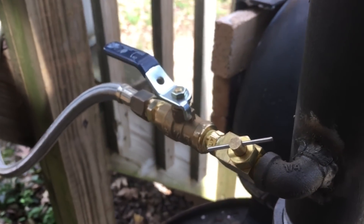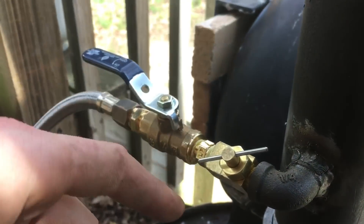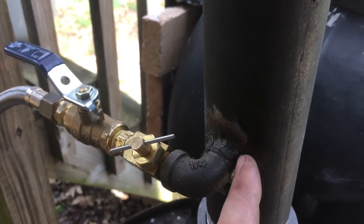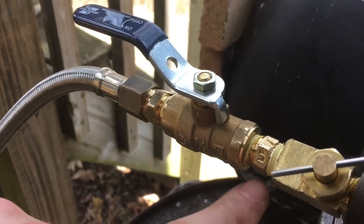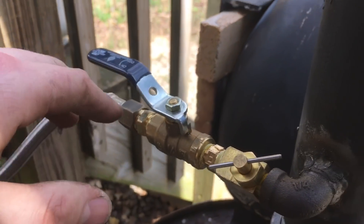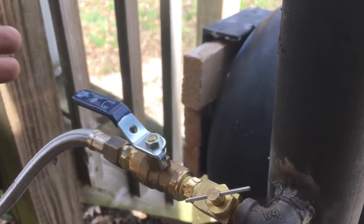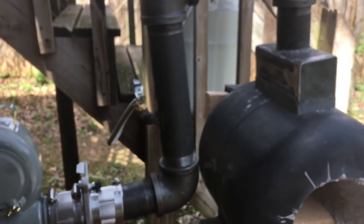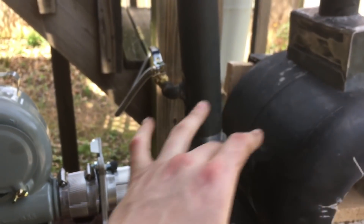Here's a quick close-up of the orifice assembly for Eric so he knows what parts to buy. You've got a quarter-inch needle valve — this functions as your gas orifice so you don't have to mess around with a MIG tip or anything. It's just piped into a quarter-inch street elbow that's welded to this. If you're not confident in your welding abilities, you can just drill and tap a hole, put a coupling in there, and just make sure your fitting is airtight. Quarter-inch to quarter-inch male-to-male hex nipple. Quarter-inch ball valve. Quarter-inch to three-eighths flare fitting. The ball valve is technically unnecessary, but it's a really nice safety feature — if anything goes wrong, you can cut the gas flow right there. The whole assembly is built out of two-inch pipe. If you're confident in your welding abilities, you can actually build this whole assembly out of either two-inch square tubing or two-inch Schedule 40 pipe, if you can make airtight welds all around.